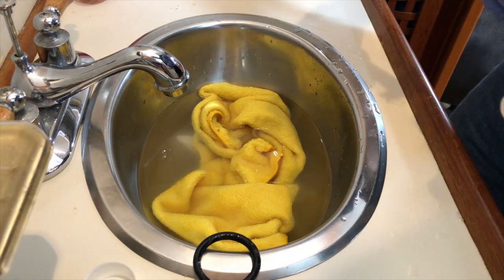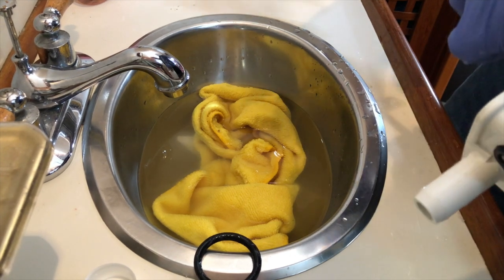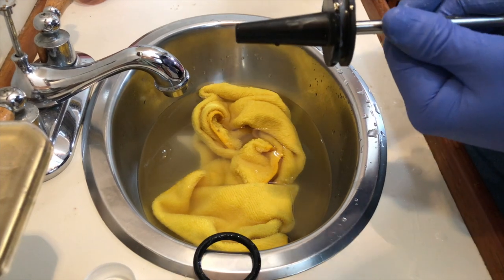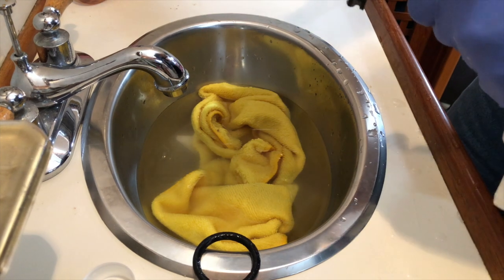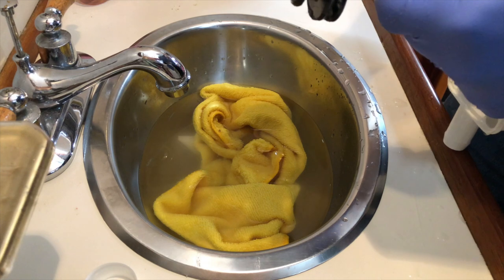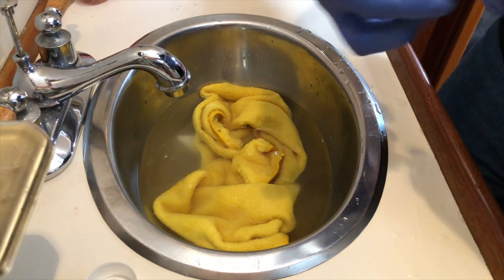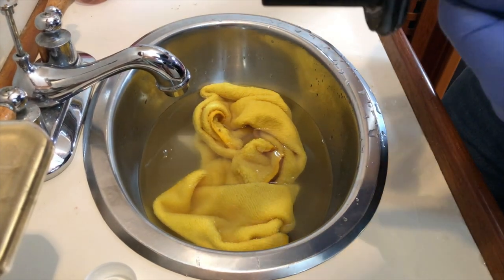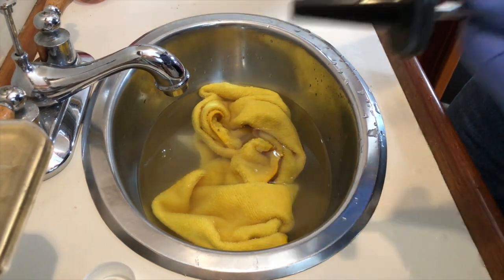So that O-ring has a good amount of lubricant to draw from as time goes on. Now I don't want it to be all over the place. What I'm looking to do is really keep that lubricant inside that groove, because when I go to put the O-ring back on over top of that, you'll notice it's going to kind of squish out a little bit, and that's okay, because that means that there's lots in there, and that's going to make that slide up and down the cylinder really easy, and that's good.